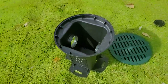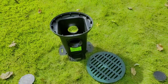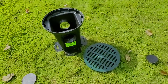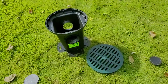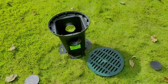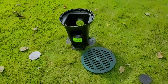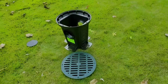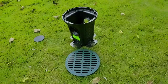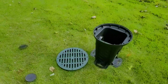For the comments section and the peanut gallery: you don't use these in French drains. This is a yard drain basin. We'll show you guys how to use these things in the future. Don't confuse this to be a French drain because it's not — they're different. A yard drain does not have any stone in it. When people try to do a hybrid system and use the same pipe, that's what we preach not to do. We'll show you how to do a yard drain and French drain combo.